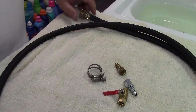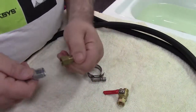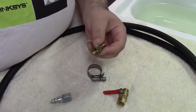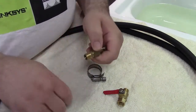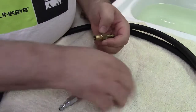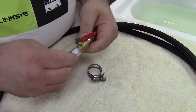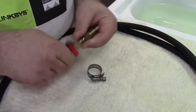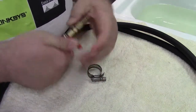Here are all the parts we're going to need. You need two air fittings that screw together — but this is what my friend had on hand, and he also had a coupler like this. So that's going to screw in here and that will screw in over here, but we're also going to incorporate the valve. One end fits inside the air hose and the other end is where your air supply gets hooked up — that's the inline valve.